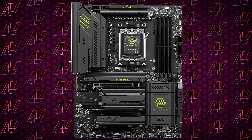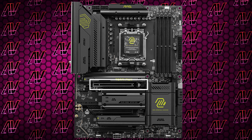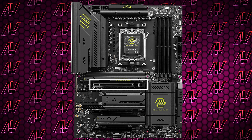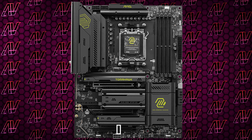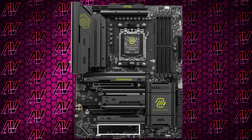While you still have the exact same three main PCIe slots, all of them physical 16X, the main one is, as you'd expect, a 16-lane Gen 5 slot. Then you get a Gen 3 1X slot below that, which could have very easily been physically 1X. And then below that, another physical 16X slot, but this one features four Gen 4 lanes.